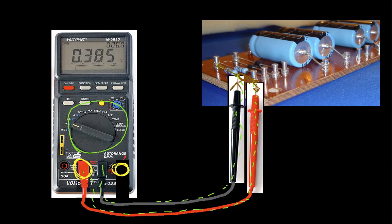Now this, in some situations, is not bad, but if I've got a circuit board that I've put together and all of a sudden I have to go cutting things to measure currents, it's obviously not good. One alternative, if I have a resistor whose value I know, would be to measure the voltage across the resistor and then compute the current flowing through the resistor using Ohm's law. Okay, so that's measuring current.